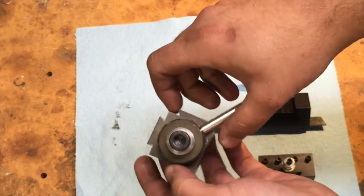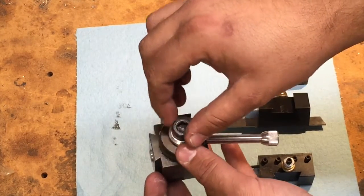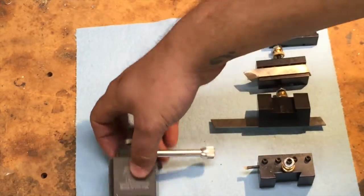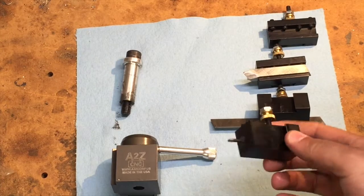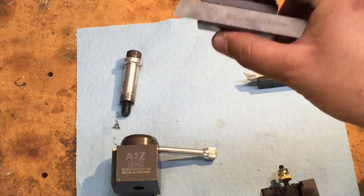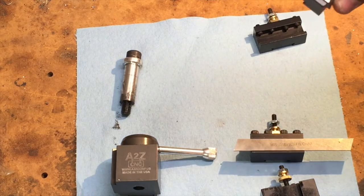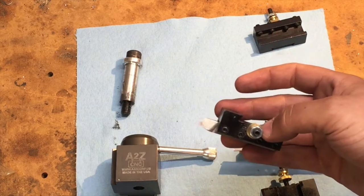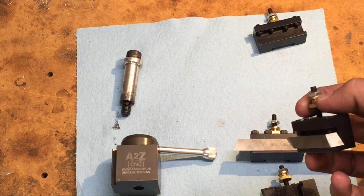To adjust the angle of the tool on the carriage, you use — I believe it's an 8mm hex wrench for that. Along with the tool holder body itself and the mounting supplies, you get a boring bar holder, a cutoff tool holder, and two tool holders. These hold standard tool bits — that's a 5/16ths tool, high speed that I just turned myself. It would hold smaller and probably up to at least 3/8ths.